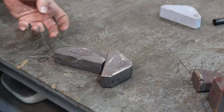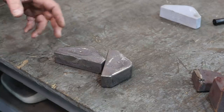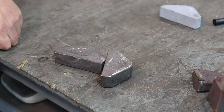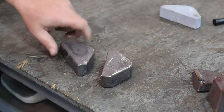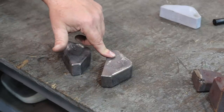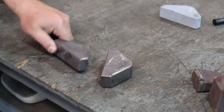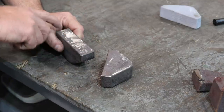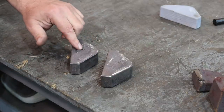That's just one of the things you have to deal with in foundry work — it takes a little bit of experimentation, figuring out where to put your risers on parts to get things to work out right. We are ready to go to the milling machine. I want to face the top and bottom of this and get these to the correct thickness. We'll also need to machine and face the front, put that V groove in there, and then drill the inch and a quarter holes that they'll pivot on.